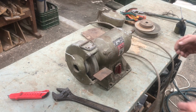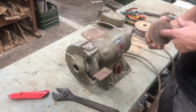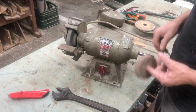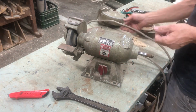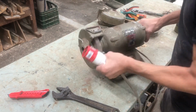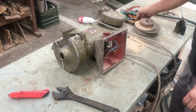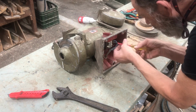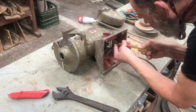Okay, so like you saw, there was tons of vibration. The wire brush had the wrong diameter hole here, so it wasn't centered, and it was jumping all around. Once I took that off, that seemed okay, but it's spinning in the wrong direction, which we anticipated. So either change this, or change one of these. I think one of these looks like an easier option than opening all this again. So let's change one of those. Well, change 2 of them. Just switch them over one side to the other.